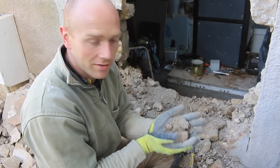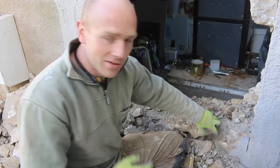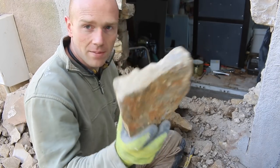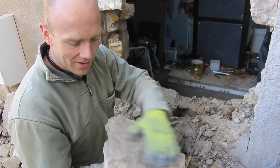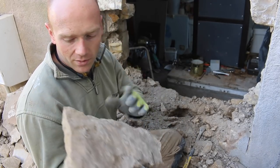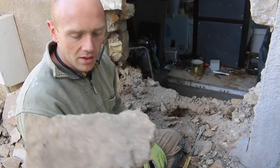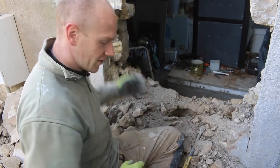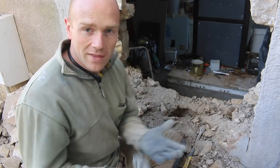You can just see how dry it is — that's because of the lime keeping it breathable. When you're demolishing it, it seems as easy as brick and lime mortar, but the stones just come out perfect, almost like they've just been quarried, and they're pretty much bone dry. We're getting pretty low down in the wall now so I'd expect them to have a slightly higher moisture level than up top, but up top they're all bone dry, really nice stones that we can reuse.